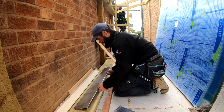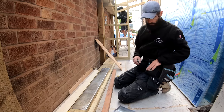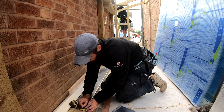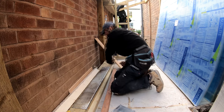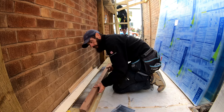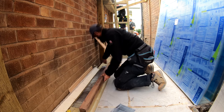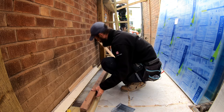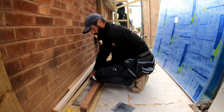I'm going to flip that over. So the next bit we've got is the upstand. Now there's not a lot of upstand up there — I believe it was 25mm. So we put a mark at 25mm, go to the other end, mark another 25mm. Get the lead bending stick with the straight edge, mark that. So this is the difficult bit — because it's only an inch or 25mm, we've got to now bend this bit of lead up. This is the hard bit.